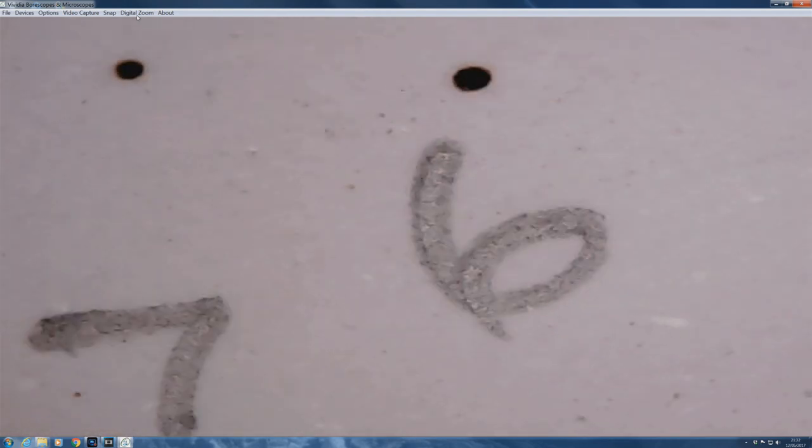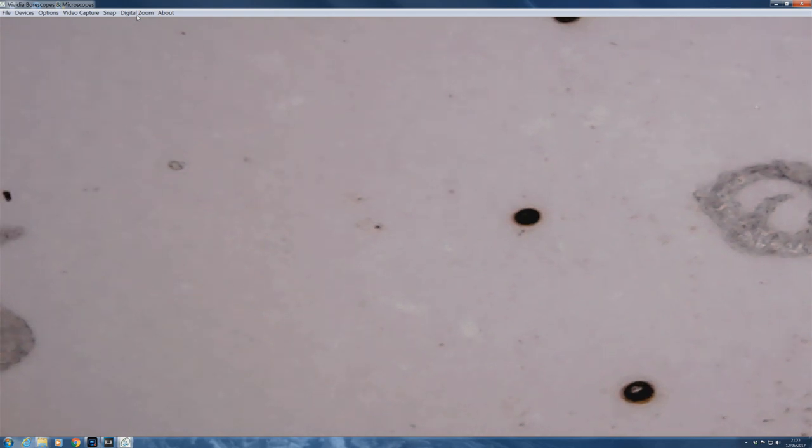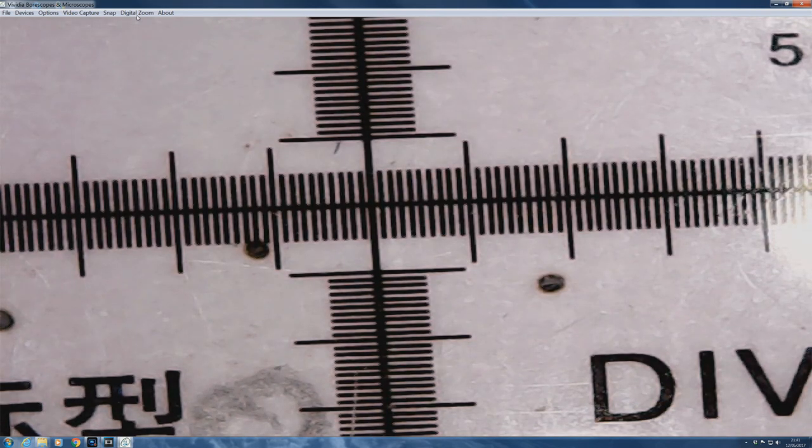Here's what a 10mm gap looks like on the Light Blade machine, then 9mm, 8mm, 7mm, and 6mm. I'd say 8mm is in the best region — it could well be 7.5mm but let's settle on 8mm as the focal point. The dot doesn't look quite round, so I turned it 90 degrees — it's still oval in the horizontal direction, which means the microscope has pixel distortion. But since the measuring graticule sees exactly the same distortion, it doesn't matter. I'd say the dot is about 0.22 to 0.23mm — already twice the theoretical.